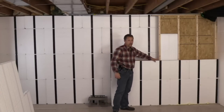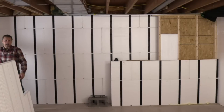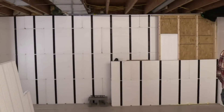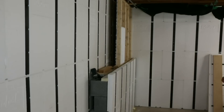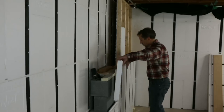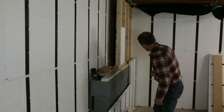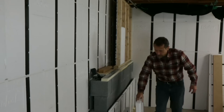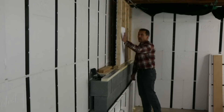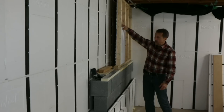So this is the step-back that we're going to cover. Let me switch to a different camera angle. There we go. So this is what we're talking about — this transition, how it steps back. Let's take these panels off. So we have our block wall, we have our step-back, we have our two-by form wall and our insulation in between there.